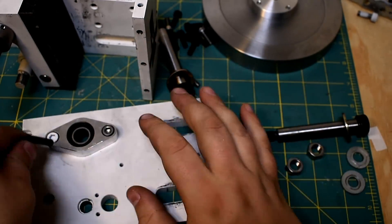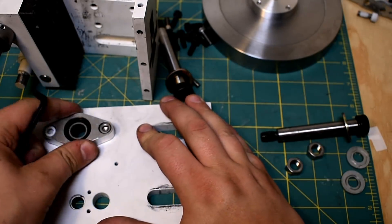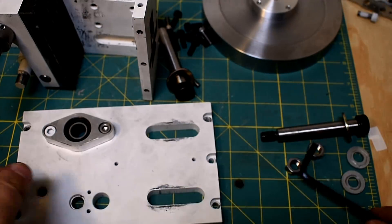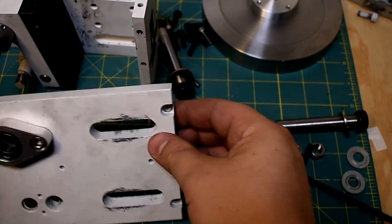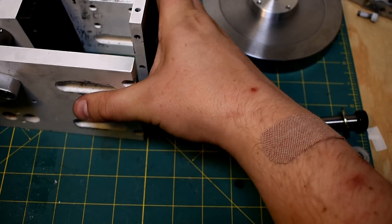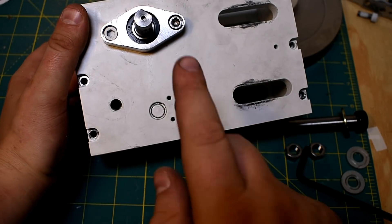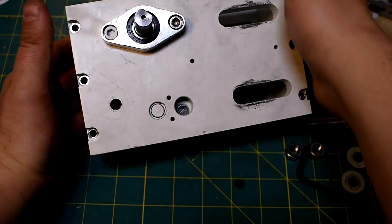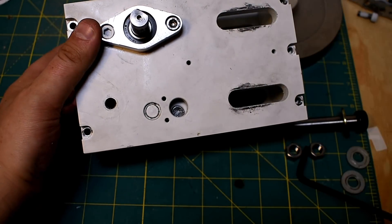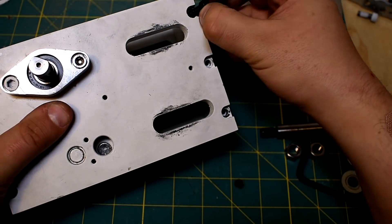The bearing got a little loose, so I'm going to tighten these up and squish the bearing back in. I'm going to leave this bearing a little loose because I want to put it together without over-constraining it. There we go — you'll notice the bushing happily found its center, so no need to worry about that. Now I'm going to start putting some M5 screws in here.